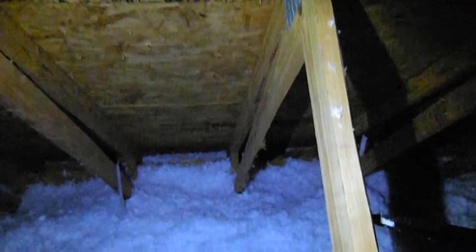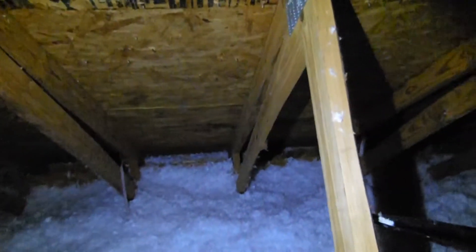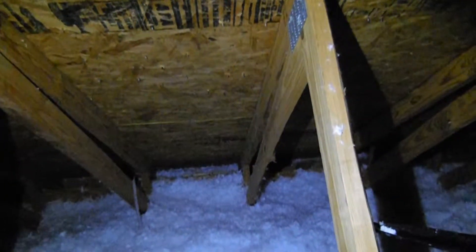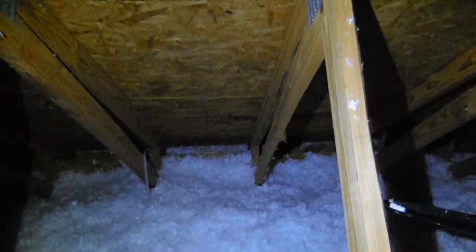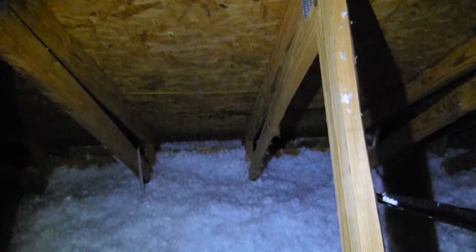I took the specs here — specs are a little bit different. Looks like you have eight penny nails; spacing is about six inches. I moved away some of the insulation at the soffit area too — you'll see some pictures of hurricane clips in there. That's what's connecting the roof truss to the wall. The clips are nailed and they look pretty good.